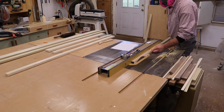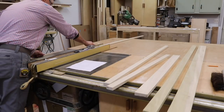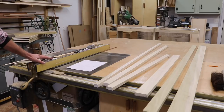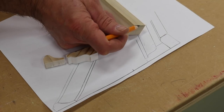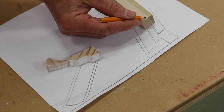Now I'll mill the material for the face frame, and I'll attach the face frame to the cabinet after the cabinets are installed on the wall. For the molding on this cabinet, at the top I'm going to make this piece of molding — starting with a piece of stock that measures three-quarters by one inch and using a fluted round-over bit to make it.